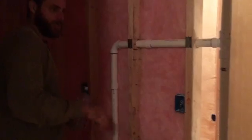I have no lights that I can turn on in the bathroom at the moment. In here we'll have a vanity, and we've got a couple of outlets there for the vanity. Three gang box — so we're going to have a vanity light switch, a stool light switch, and a shower light switch, because the shower has its own can light. That way we'll be able to turn on the overhead light here or the overhead light in the shower independently.